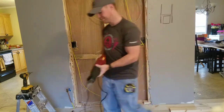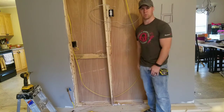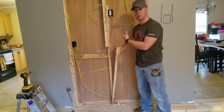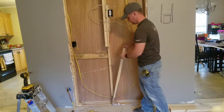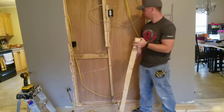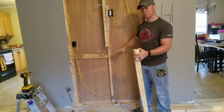That's cut all the way through now. I don't recommend doing it that way — it's a little dangerous, but it's the easiest way and the job's done. Now I take this board here and pretty much just pull it out. This one's barely hanging. There's some of the mobile home framing in here — that's where they support it. I might go ahead and add another stud here to the header.